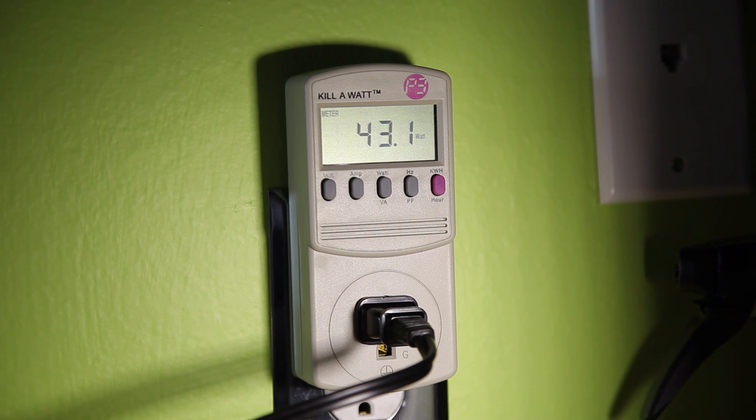When you're charging a rechargeable battery, you'll see that it starts out high and as the battery gets charged, it'll go lower and lower in terms of how much power it's drawing. If it's not a battery charger and just a regular device, the wattage it draws will generally be pretty consistent — for instance, if it's a clock radio or some other device like that.